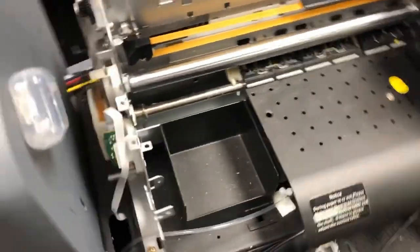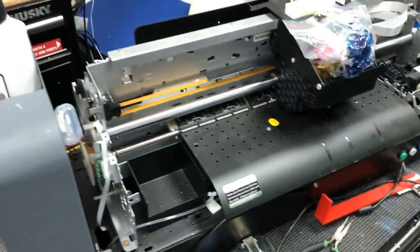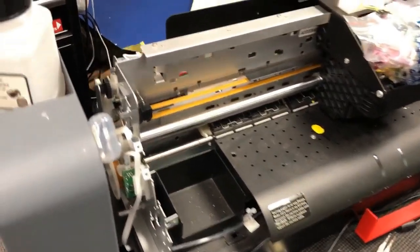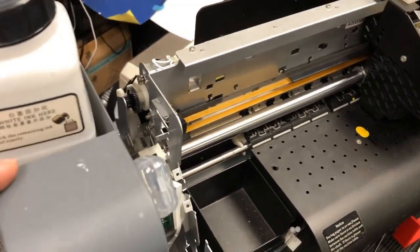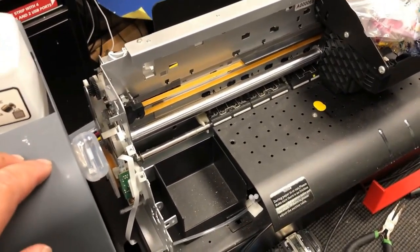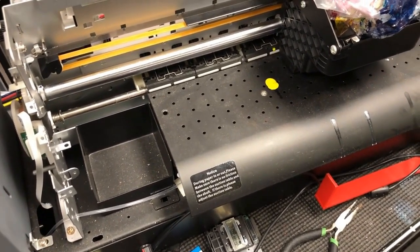What makes this a $4,000 printer is the white ink management system. The biggest difference you can find between a $2,000 printer and a higher-end printer is the white ink management system. White ink is essentially white paint — it's latex — and you're putting latex in your printer. You have to keep the ink moving and circulating. I've seen printers that don't have a direct-to-damper circulation system, or they only circulate in the tank — it's mixing, not circulating. That little difference makes a big difference in the life of the printer.